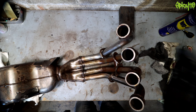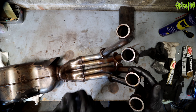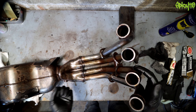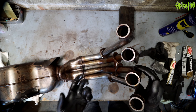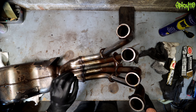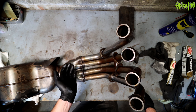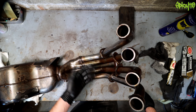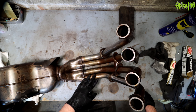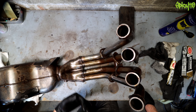This is obviously where Harpic comes up — these aren't stainless steel as far as I can tell, so it's not the same deal and I don't advise doing that here. Really, you shouldn't use Harpic — basically an acid — on stainless steel either, because you can leach the chromium out of them, which means they lose some of their stainless effect and can rust quicker. Also if you get Harpic onto aluminium it can be very corrosive, so if you do use it on your bike, make sure you wash it off thoroughly. I've used it maybe once a year on my XJ6 replacement headers and seen no advance in rusting — they polish up lovely — but these currently are steel, so I wouldn't use it on these.